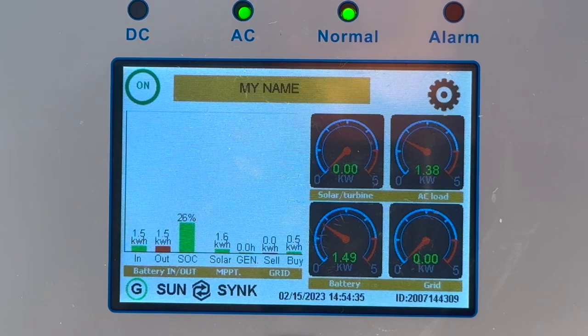As the power drops below 26%, you can see the system is dropping. It's dropped to 25%. Within a short period after it drops to 25%, the system will shut itself down. The bypass will still operate, but the shutdown means the inverter will drop its quiescent current to near minimal. We wait a little longer and you'll see it go from normal to off — entering ultra low power mode.